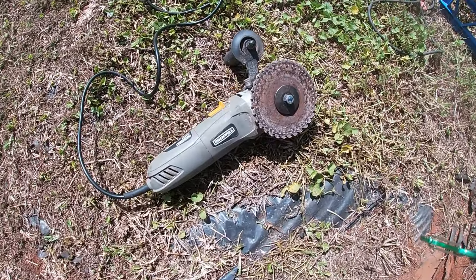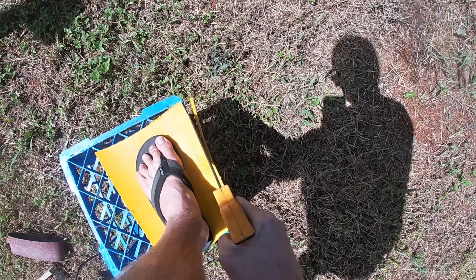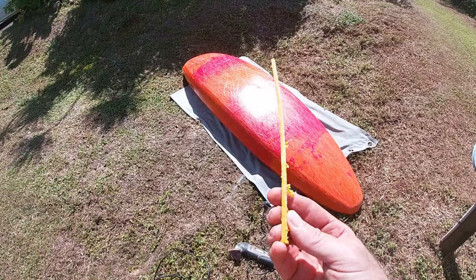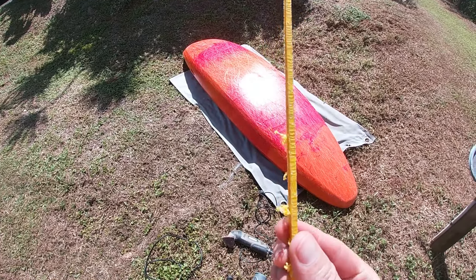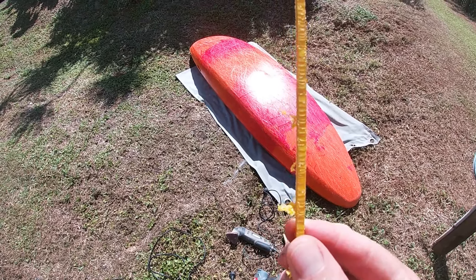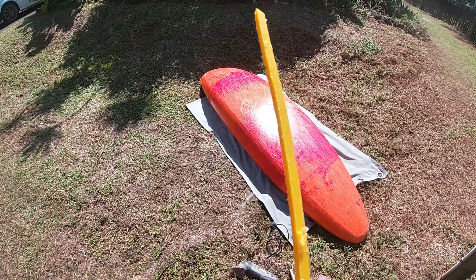To cut this plastic rod for welding I could use a circular saw to chop a nice edge off, but today I'm just going to use a hand saw. Now that I've cut a little edge of plastic off — which is my rod for welding — I want to clean it up, sand it, and make it nice and uniform. Ideally the thickness of the plastic is how thick you want your rod, so it's kind of square or circular — a nice clean rod to weld into that crack.